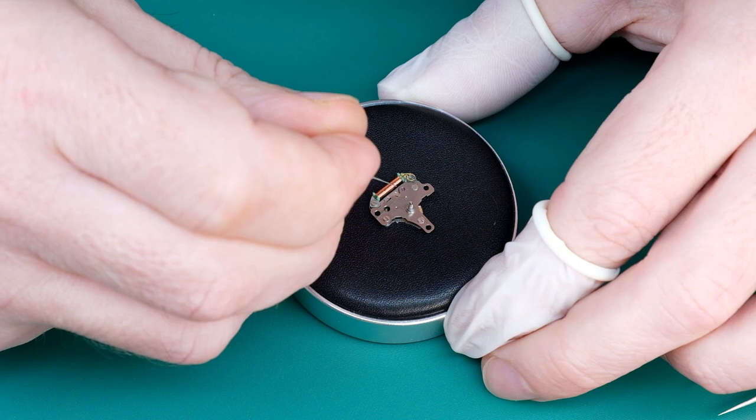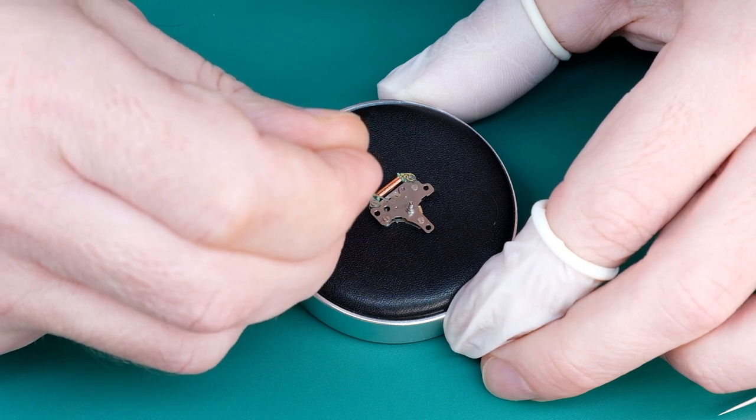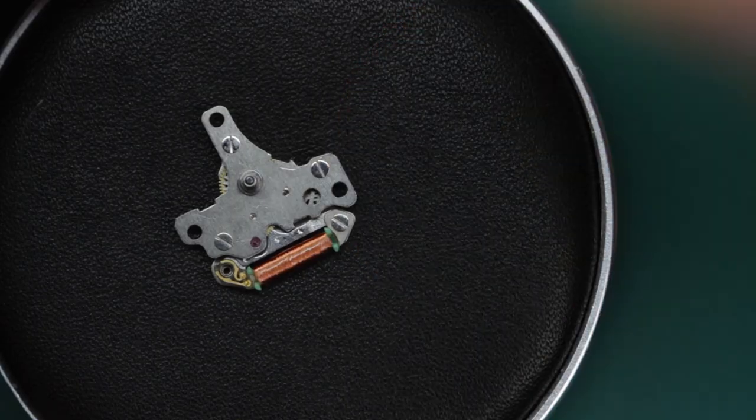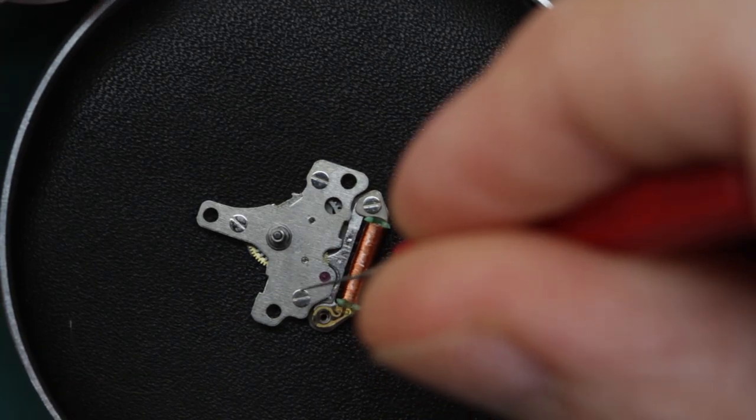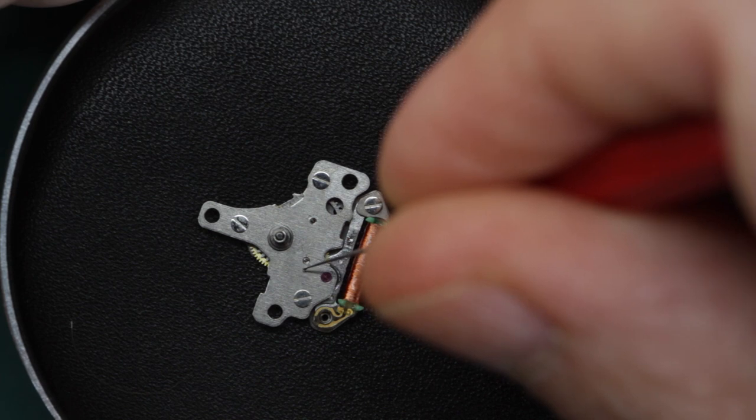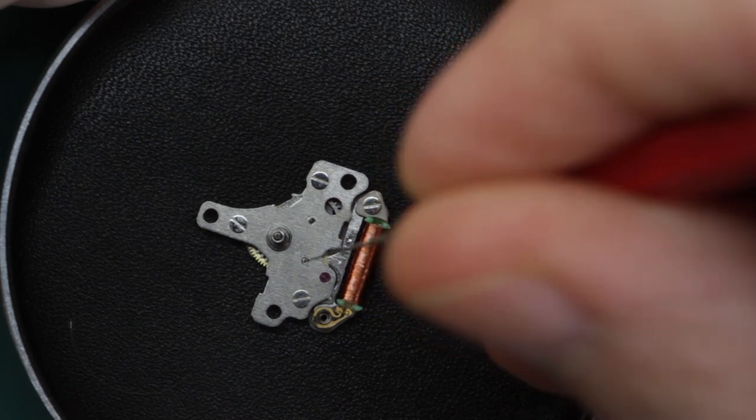Moebius 9010 all around. I should also point out that the amount of oil required for this movement is minimal. The tiny motor and small electric current does not have enough power to battle thick amounts of oil.